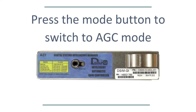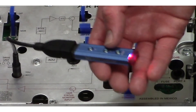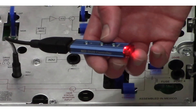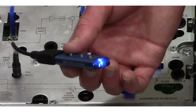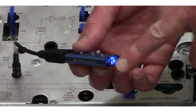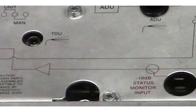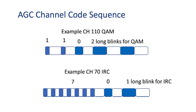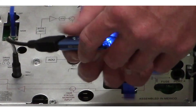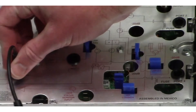Now that the amp is properly set up, simply press the mode button once to go from manual to AGC mode. The align process will take about 30 to 45 seconds. When done, the LED on the controller will blink blue indicating the DSIM is now in AGC mode. The LED on the DSIM itself will flash the channel number pattern followed by one slow blink for analog or two slow blinks for QAM. Remove the controller from the cable, then remove the cable from the DSIM. The setup is now complete.